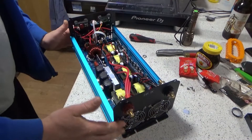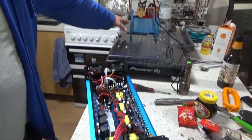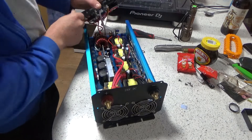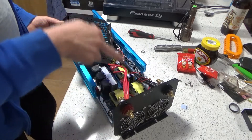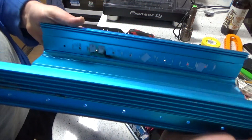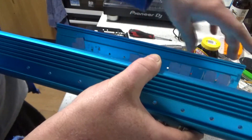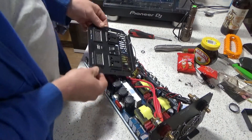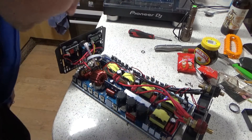I'll pull the board out and have a better look now. Things are relatively easy to disassemble — removing four screws on each end gets the top half of the casing off, then do the other four and lift this side up. If this has been live and working you might find capacitors are charged, but this has been dead for a while. The MOSFETs are all clamped with little clamps to the casing, which is used as a heatsink on both sides. If the inverter has been working, some of this stuff may still be electrically spicy.